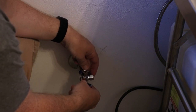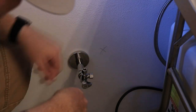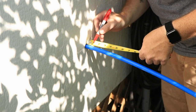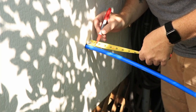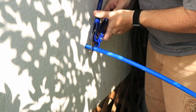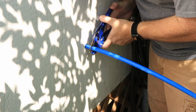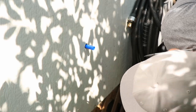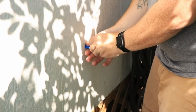That's just a little decorative collar spacer that I'm snapping on there. It's just SharkBite, so all you do is push it on the tubing and it locks in place — bites down. Here I'm measuring about an inch and a half out because the SharkBite depth is probably about an inch to an inch and a half. The SharkBites bite down so deep and I was trying to precisely measure exactly where I wanted that SharkBite to stop. I'm using some regular plumbing cutters here, making sure it's perfectly straight up and down, and that cut easily with the plumbing cutters.